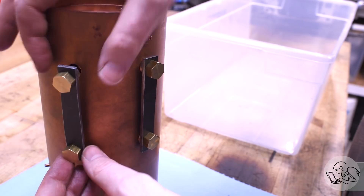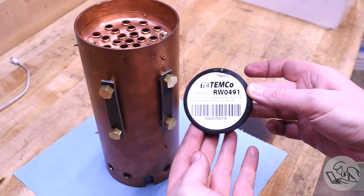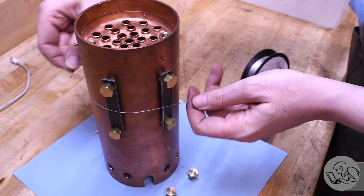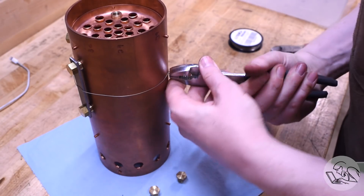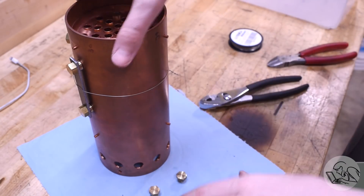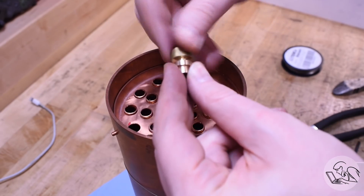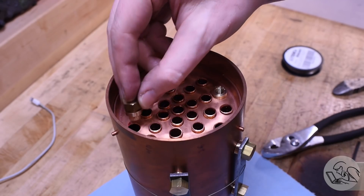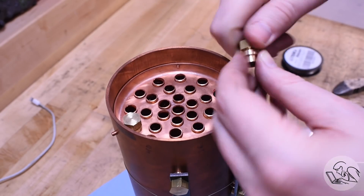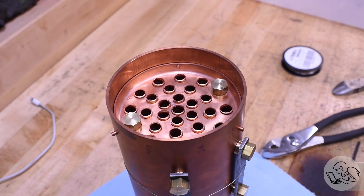That looks good, and I'll do the other one the same way. We need some way to retain those because they tend to fall out. I have titanium wire, which sounds exotic but is actually really inexpensive. It's recommended for jobs like this because it can take the heat and silver solder does not stick to it. For the top bushings I'm just putting the plugs in to protect the threads inside from the heat. The plugs also add mass to the bushings and help keep them from getting overheated by the torch - it's quite possible to melt a boiler bushing if you get a little carried away with the torch while silver soldering, which is something I have done.